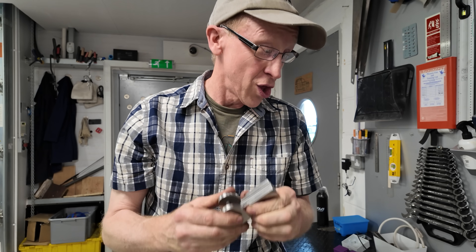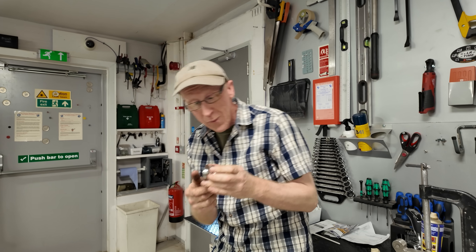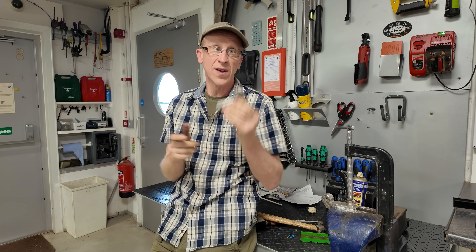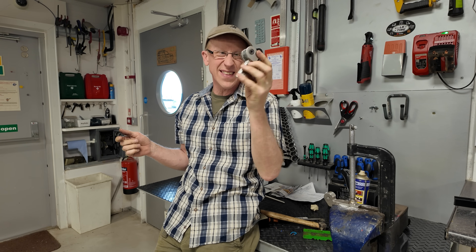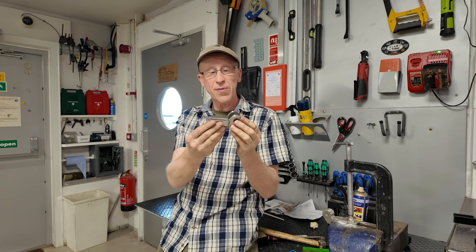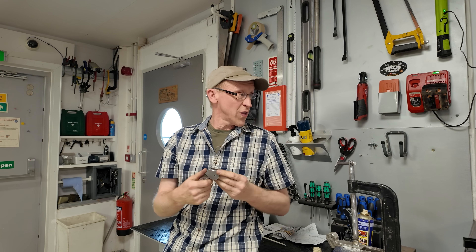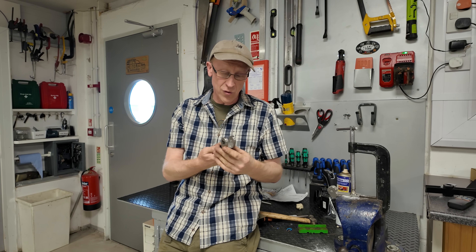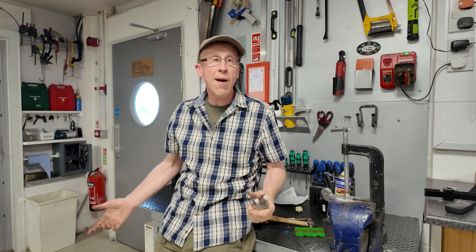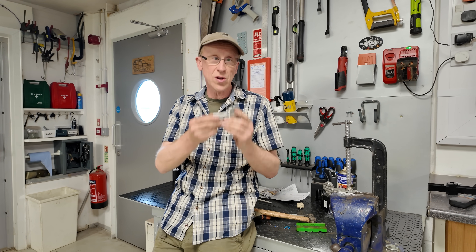So I think it's possible to design — even with this stress concentration — a hinge that is more than capable of taking the load. It's a material choice. We are going to make stainless steel replacement hinges available. We wanted to test the CAD data and determine which material to use, and stainless steel wins. Give us a few weeks — email in or keep an eye on the website. They're not going to be cheap because they're machined. Land Rover may say 'we use cast materials for cost,' but you can see the difference — it just sheared the bolt at three times the load.